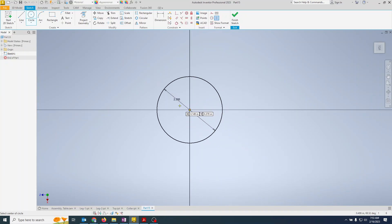There's my 2.5 circle. Before I put in the other two circles, I'm going to lay down a vertical line, then another vertical line, and say those two lines are equal in length. I'll select both while holding Control and set them to construction lines — not required, but it keeps your drawings nice and clean. Then I'll pick the endpoints of those lines for my part.